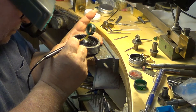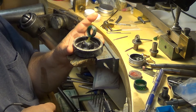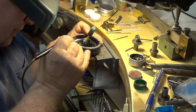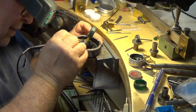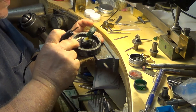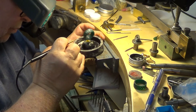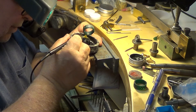Last thing you want to do when you're putting these in a vacuum cast machine is have that screw break loose and not know it — and then you cast it and all you've got is a big pile of nothing. I've had that happen. When I teach this, I make sure that the students grease these flasks, because if you don't do that it's just a mess to try and clean them up. You save a lot of time by doing that.